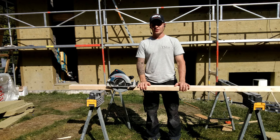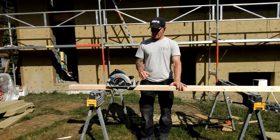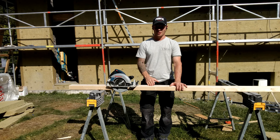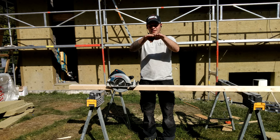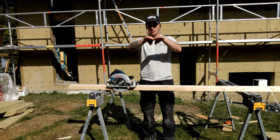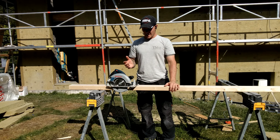In this video we're going to learn the definition of what a pinch point is. A pinch point is when using a saw and cutting through material, the material bends downwards and causes the material to pinch the saw blade as you're cutting, which will always cause the saw to violently kick back — and a lot of times it comes back across towards your other hand that you're holding your material with.